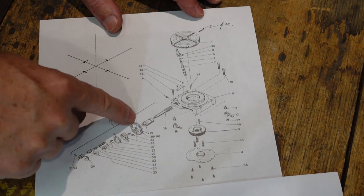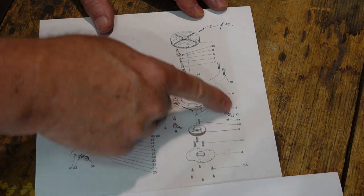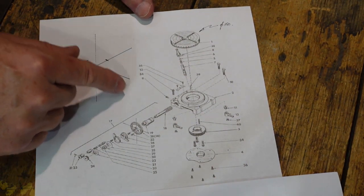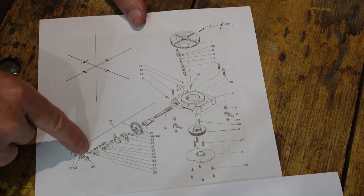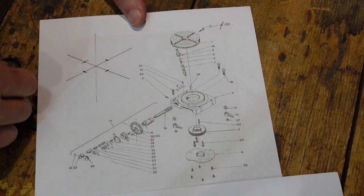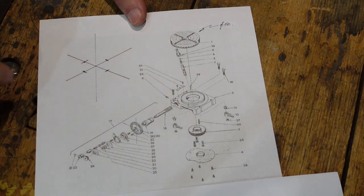It turns out that 150 millimeters in diameter is equivalent to 24 millimeters on the page. Down here there's a disc - I've put a vertical line and a horizontal line through the center line and measured them; they're both the same size. This is important because sometimes drawings are scrunched to fit on a page, so this confirms the scale is consistent in all directions. I can now start measuring - for example, that height is four millimeters, so four divided by 24 gives me the ratio, and that gives me a measurement.